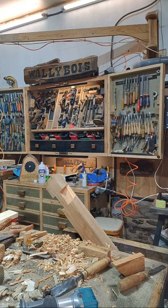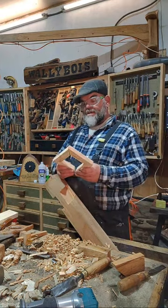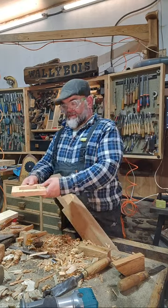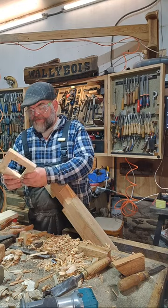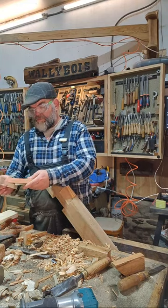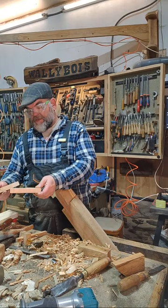If you are doing a picture frame or something like that, and you've created all your 45s, and that last 45 seems to be slightly off and just not quite coming together, well, it's easy to sort out. What you do is you don't do three, then try and get the last one sorted. You do them as two separate halves.